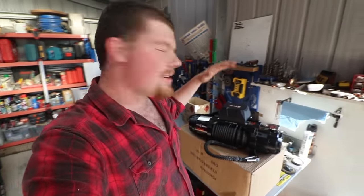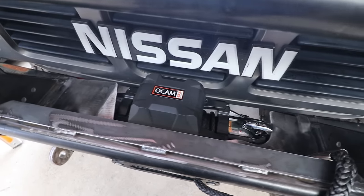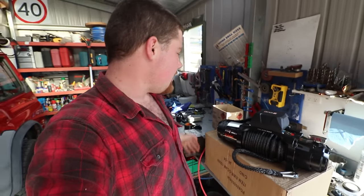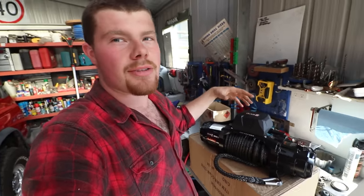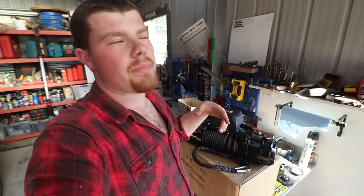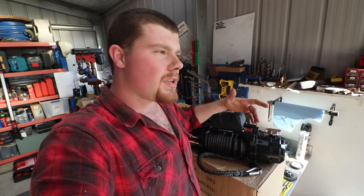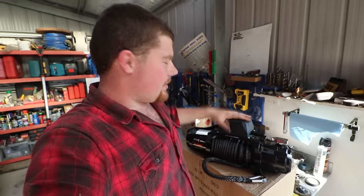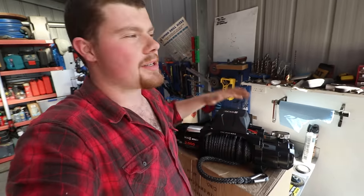It's now the other side of the weekend. The paint on the bar is dry and it is looking amazing, so it's time to get ready to mount this bad boy in. This is the OCam 12,000 pound winch, which I spoke about earlier. I pretty much fabricated the bar to suit the winch, which is a bit backwards, but that's how I roll. I'll go through a lot more of the features later once it's actually in the bar and we can test it, but basically for mounting options — this is the relay box, which you can either remote mount or mount to the winch. It comes with mounting holes on top, so I've set it up that way, and when I made my cover plates for the bar, I made allowances for that so it could mount right there. I thought about mounting it in the engine bay, but there's not going to be that much space, and basically I figured the shorter I could keep the control cables from the relay box to the actual winch motor the better. It's all waterproof anyway, so it's fine to be out in the weather.